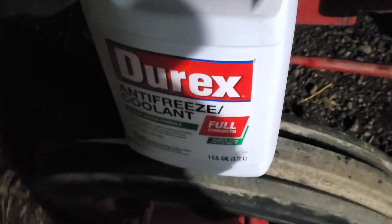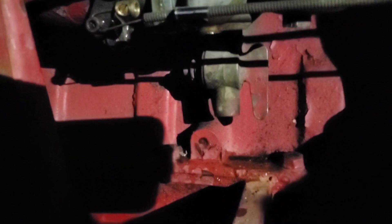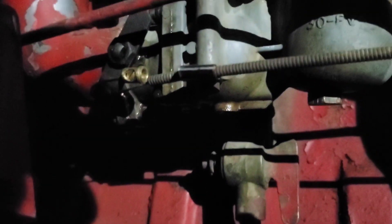Now that I've let it flush out and had some dinner, it's time to add the green juice — you gotta have that antifreeze in there. For you guys that have these, at least if they have the same valve I have: unlike any ball valve in the US, the closed position is actually what looks open, and open is what looks closed. I did let it drain down. If you're working on a Kubota or apparently a David Brown this old, the ball valves work backwards compared to any other one in the US — just in case you were curious.